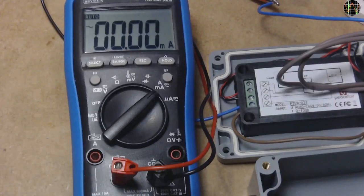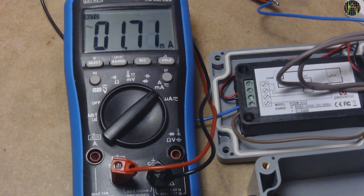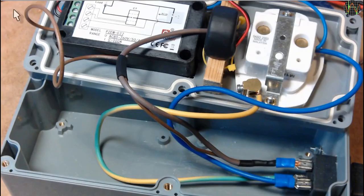I don't think I ever measured what current the module itself uses. Let's do that now. After the inrush current settles, we have about 1.7mA. That is tiny, so the error caused by the wiring mistake is very small, but still something that can be easily avoided by tapping the power for the module from the other end of the live wire. I have simply moved the thin brown wire feeding the module from the outlet to the inlet, so the current is no longer passing through the transformer.